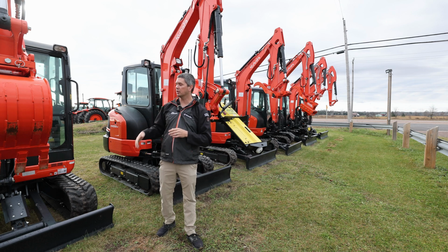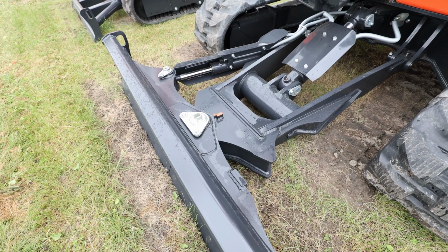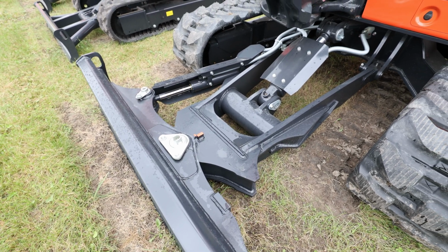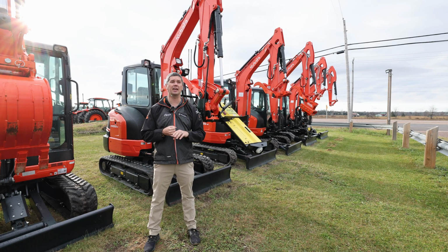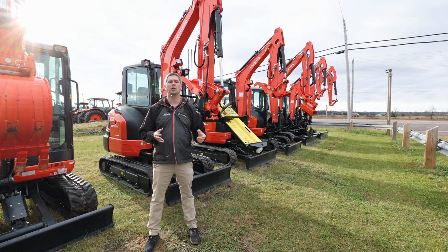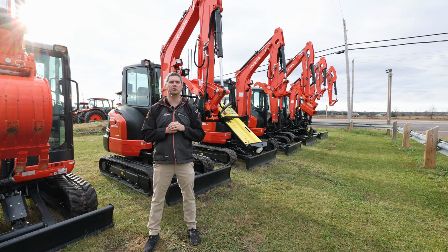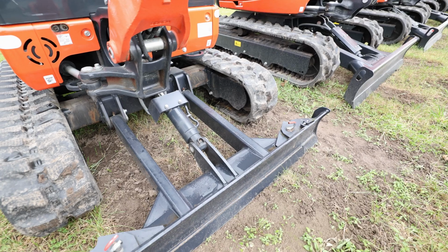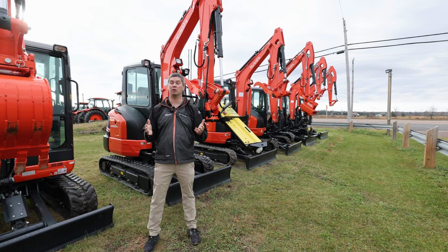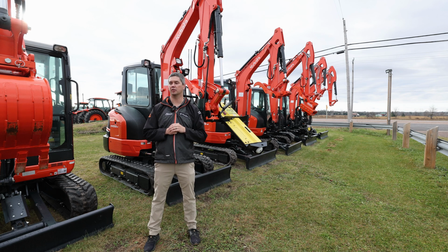One other option to consider, especially as you get up into bigger units, is angle blades. So you'll see just a few select ones here with the angle, but again, they're more on the bigger end. If you do have a choice, they're either going to be coming straight, angle, and then the 040 does have that 6-way blade mixed into the lineup. Strongly recommend, if it's a one operator machine, getting that angle or 6-way blade. After that, if it's just multiple users, straight blade is definitely the way to go. And maybe everybody deals with a budget, and straight blades are obviously cheaper.